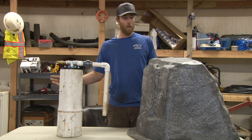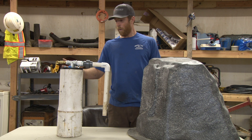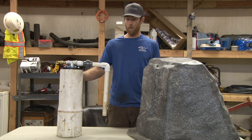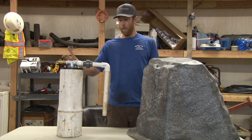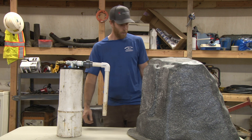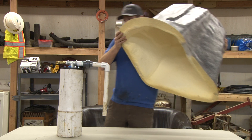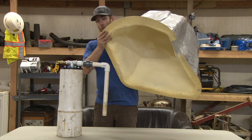These are suitable for climates where the frost line isn't that deep. Obviously the further north you go — towards Canada and Minnesota where it gets very cold — you're not going to have this type of well installation anyway. You're going to have a cap with a pitless adapter where your pump hangs three or four feet below the ground.